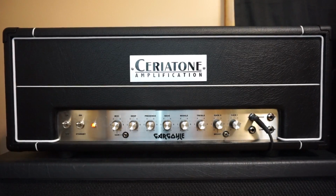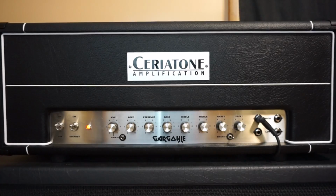Or say you have a really transparent tube amp that does the same thing. You're running into higher cost territory at that point. But I think realistically, you can find for $115, $120 a piece, a couple 1x12s with effects returns this day and age. And as I showed on a recent power amp shootout, the power section of this amp is actually really respectable. When you put a genuine tube preamp in the effects return and send the speaker outs to a real 4x12 cabinet, it's really hard to tell the difference at first between that and a real tube power amp until it gets to breakup territory.